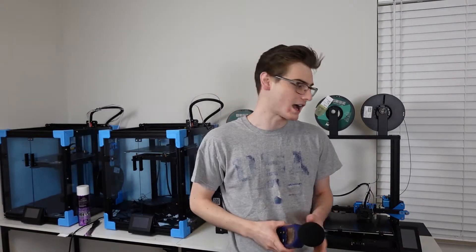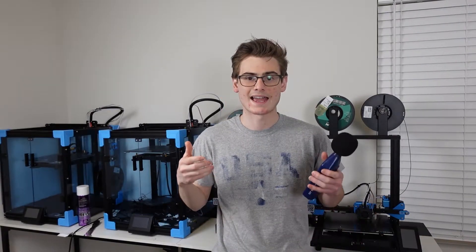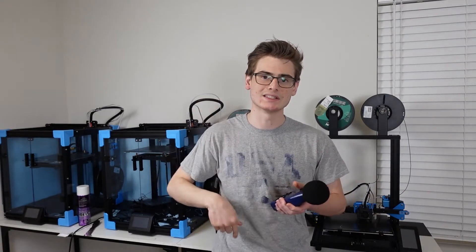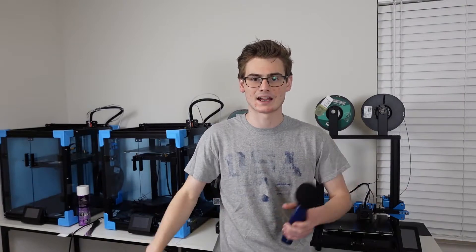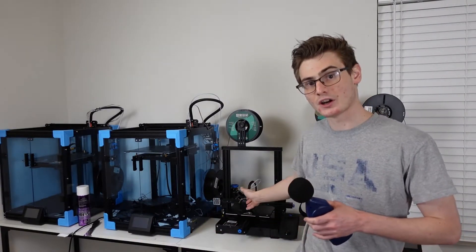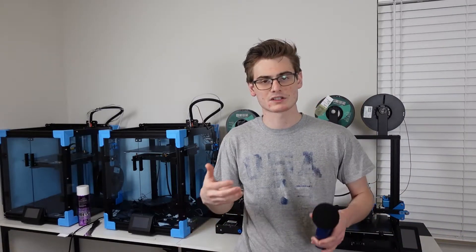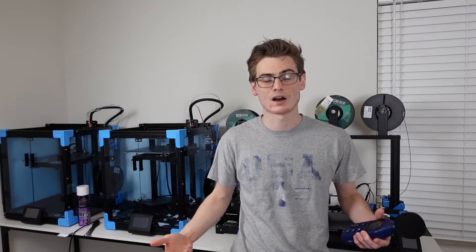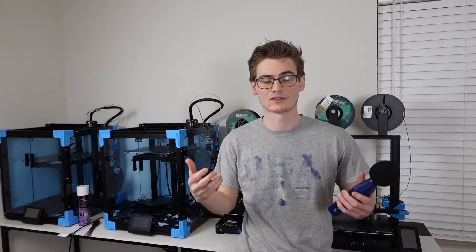Essentially, I am gating out all of the unnecessary loud sounds that don't actually come from the Sovol. I've got a 3D touch on this unit and the 3D touch is extremely loud — when it probes the bed, it spikes to at least 60 dB. So I have gated that out. Now on the Ender 3, I have a CR touch and the CR touch is a lot quieter than the 3D touch, so I don't have to gate that out. There's only one plot for that one.